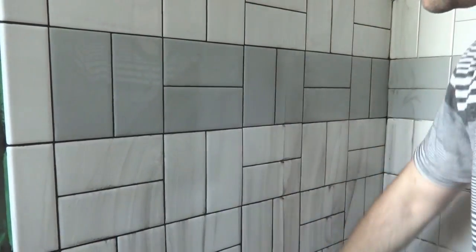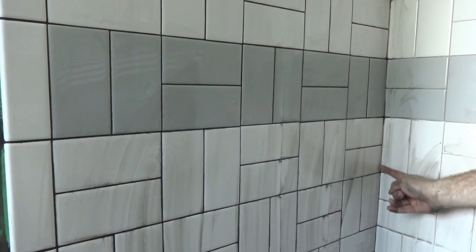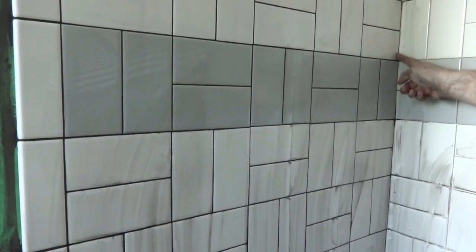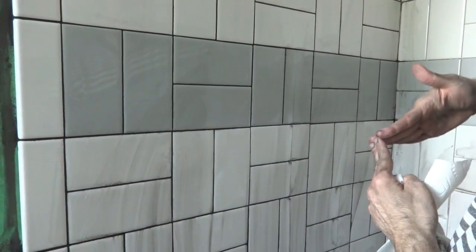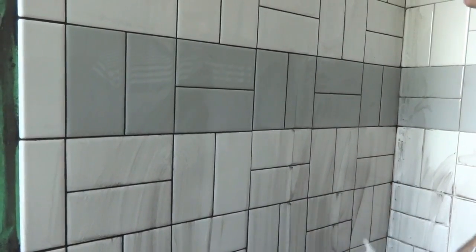You'll probably have to go over it a few times. Also, I tried to leave the corners without grout — I still got some in there but I'm trying to leave them as empty as I can, because I'm actually going to run caulk down there. I'll use black caulk because there's a chance the walls might move as the house moves and the grout would just crack. The caulk will give it a little bit of flexibility, so after it's all done that's when I'll deal with that.